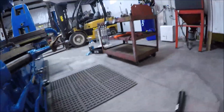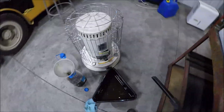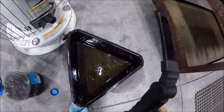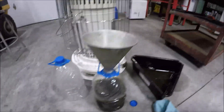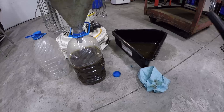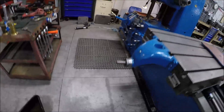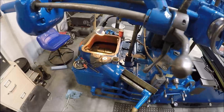I am glad I got into it because here's what came out of the bottom — it's just grime and grunge, no metal chunks, happy about that. But this is all the oil that was in that big case. It's supposed to have five gallons — what do we have here? A little over half a gallon of oil, and that's it. I'm glad I decided to go in there and do the maintenance.